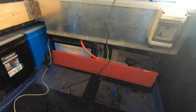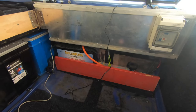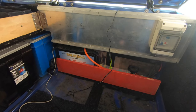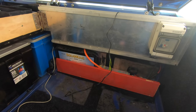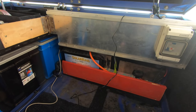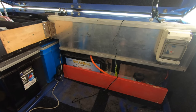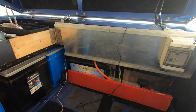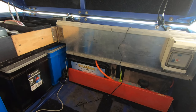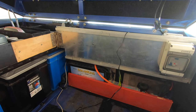The inverter is what's called a wide-bodied inverter - it's got a really wide body on it, a lot more aluminium in it to help spread and shed the heat. That's why I went with a wide-bodied one instead of a narrow one. I could have got a two kilowatt inverter almost half the width, but then the fans are running all the time. In this one the fans won't come on - it's got two little fans and they won't come on until it hits 40 degrees Celsius.